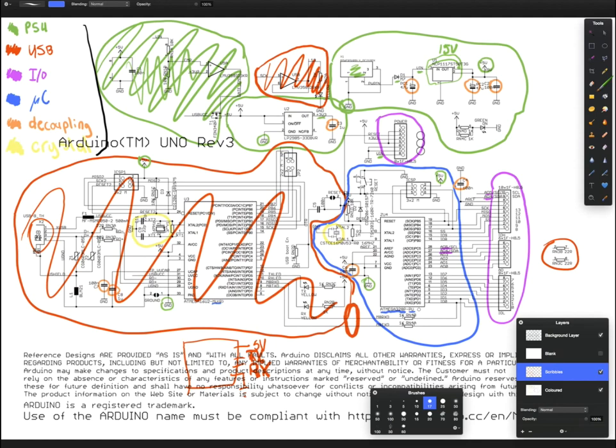Now, that's probably the one you want to start with because it's a lot easier to solder, it's a lot larger, so routing becomes easier. And depending on how you're routing things, the fact that it's through-hole can also make things easier. So it's not actually drawn with its pins in order. It's drawn with its pins in the right way to make the schematic look neat. And this is very normal too. Sometimes you'll see, like up here, it is close to being in order. They've just swapped 2 and 3. But otherwise, it's mostly a preference thing. So just as long as you stick to one, then that should be fine.